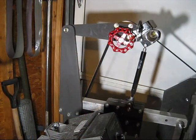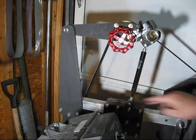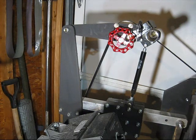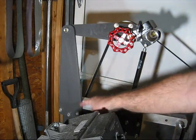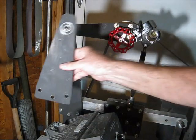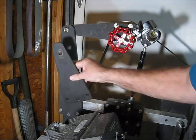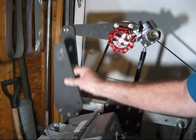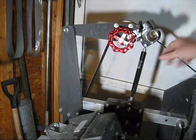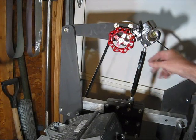Here's my grinder in the box. As you can see, I've got my tracking arm parallel to the ground, parallel to the tool arm. The way I did that is I made a new piece here and extended this up. Here's the piece that comes with the kit — you can see how much lower it is. I had to fabricate a new piece to raise this upright support so that I could get my arm parallel using the spring option that version 2 has.